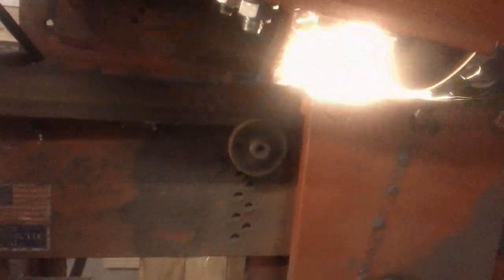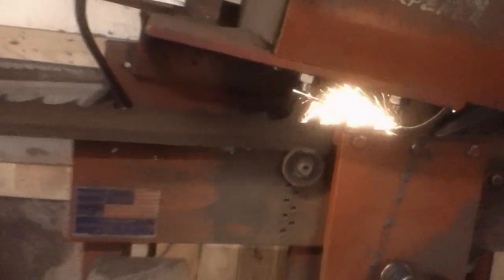As you can see, I'm making sure I'm getting the face top angle and also getting a good cut. What I usually do is touch the top of the teeth — if they feel like a needle, they're sharp. You can also look at the faces, check them to make sure you've got a good point on them and you're getting a good grind on them.